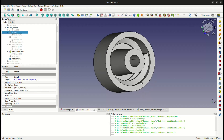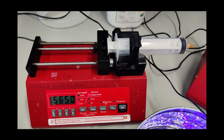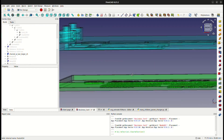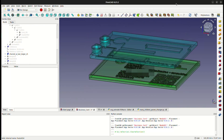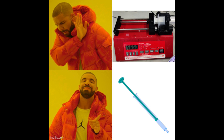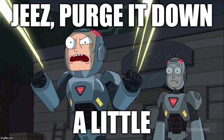Finally, the inlets and outlets were designed with Luer-type connectors, for which I had some blunt needles typically used in microfluidics. That way, I can easily screw on tubings which can be connected to anything. With these designs, I had the choice of printing two halves separately and bonding them, or printing in a single piece. The first approach is easy to get clean channels, but bonding may clog those clean channels. The second approach is hard to clean but does not require bonding. To flush liquids, I tried syringe pumps, but ended up using syringes and my own hands because of simplicity, and I was able to make quick brutal purges by hand, which helped me a lot in getting rid of air bubbles.